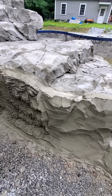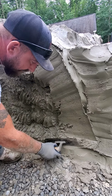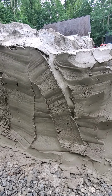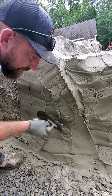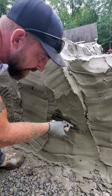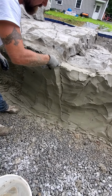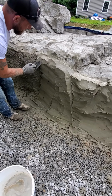I'm going to come back over on this and do the same thing. I'm going to pull to blend, and this stuff is looser. So this is the stuff you want to be prepared to be one and done. Again, we're doing basic rock here. I'm going to take now and I'm closing it, and as I close it, I move around just to get some rock form once I'm ready to texture it. I am not going crazy with pressure here, barely touching it. As I go, I'm just cleaning it, keeping sharp edges with some shape.